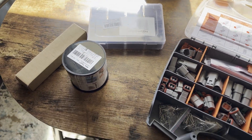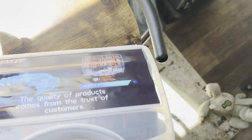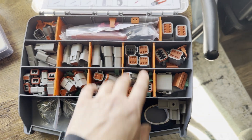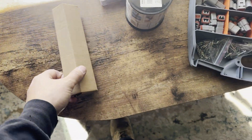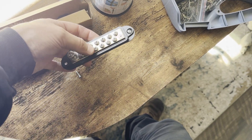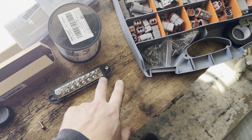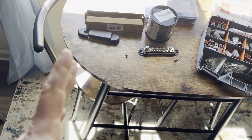For the end of this video, we had to order some stuff and it just came in. I decided to go with these type of connectors — you can get this entire kit, it's pretty inexpensive on Amazon. This is going to be the connectors at the motors. We'll use whatever terminal amount we need at each motor. Got a big thing of heat shrink, some wire loom — the good woven kind — and then I also picked up a ground bus. What I think I'm going to do, if I can fit this in my electrical box, is run all the shielded wires to earth ground — basically to the ground bus — so they'll all come down to one location. That way they can drain any residual voltage from the kick-on of the plasma cutter.